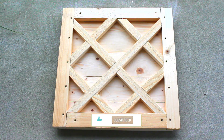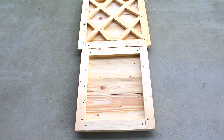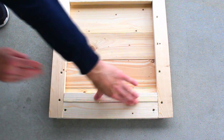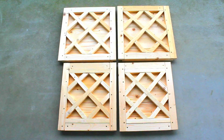Because the side panels are a little thinner, they are more rectangular than square in shape. The decorative pattern will not work with the 45-degree angles that I've already cut. To remedy this problem, I'll add two additional trim pieces at the top and bottom to square out the area. This will allow all the patterns to remain similar, the only difference being two will be a little smaller.